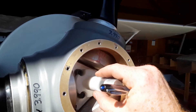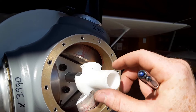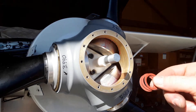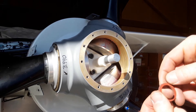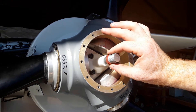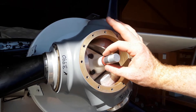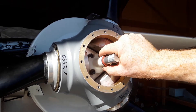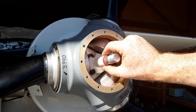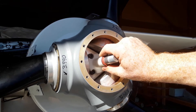This is the high angle stop that we're talking about. We've got our three fiber washers here that came with the service letter kit. We're just going to put those on, slide it up against the high angle stop, and make sure the high angle stop is pressed back in there and it's not hung up on the washer or on the screw head.